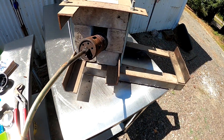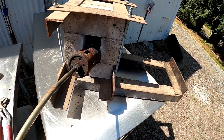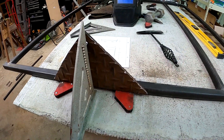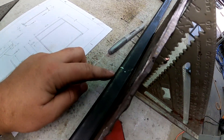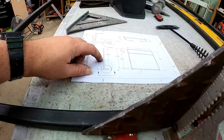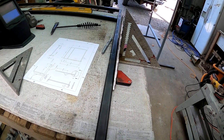As part of the process, we're making a handle in my little forge — and here's the finished handle. We're now installing the brackets at 28 inches from the top of the frame; we've made marks with a silver Sharpie and I'm using my triangle magnets to space it approximately in the middle of the beam, as the design specifies. This could be adjusted to be flush on the ground, but we're going with what the design has. We'll get it tacked in.